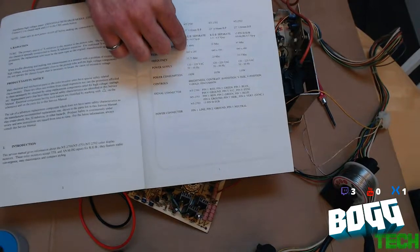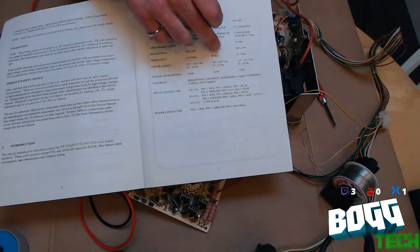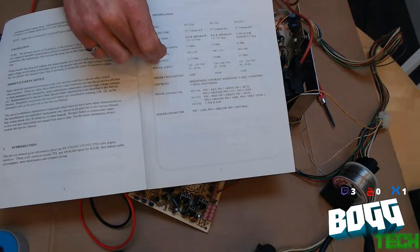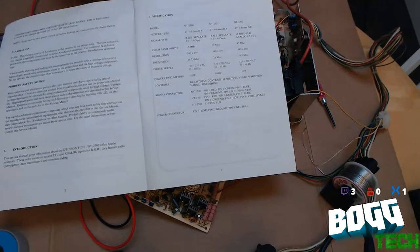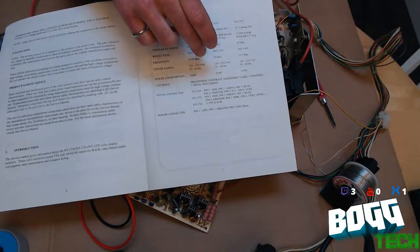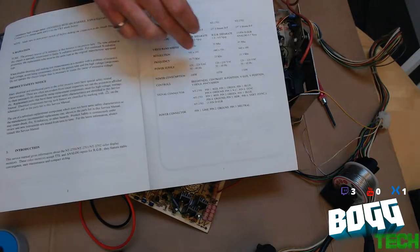So if you look at this, you see 15 megahertz video bandwidth, 560 by 240, 30 is 640 by 350, and 45 megahertz bandwidth is all the way up to 640 by 480. And this is the frequency of the monitors it drives. You can see 15, 25, and 31. So the horizontal output transistor causes the electron beam to fire across the screen left to right, 25 kilohertz.